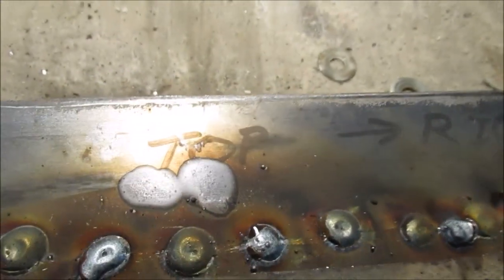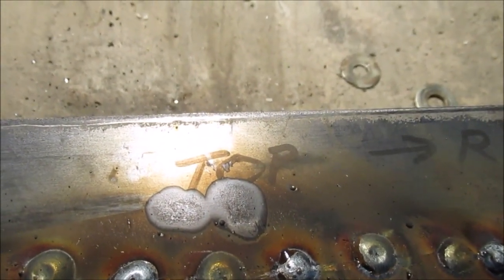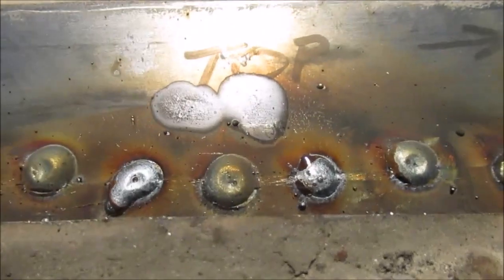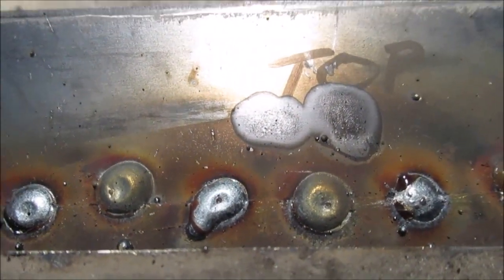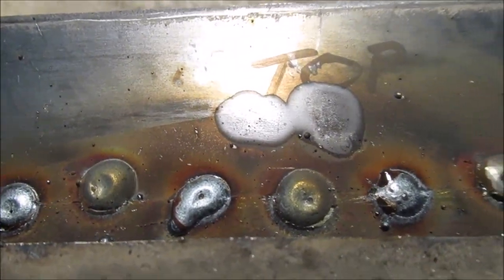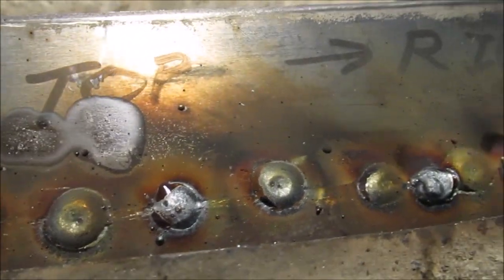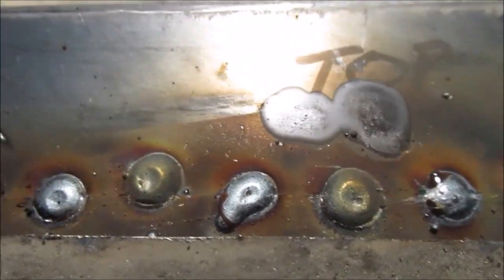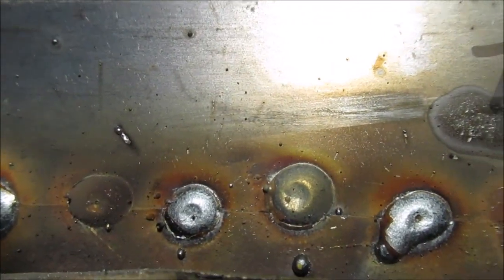My 148 Lincoln welder wanted like 5 wire speed and D. We're doing really fast wire coming out. See how big they are? We had it on like C and then 4 for the wire speed. No, we cranked her up. Even though that's eighth-inch steel, we wanted some big heavy-duty spot welds, so we really got it going in there. So it looked rather nice, huh?